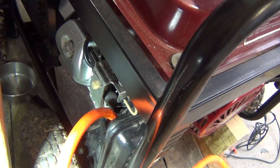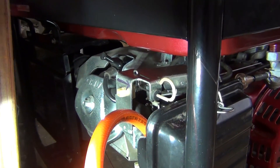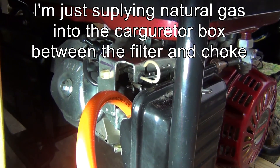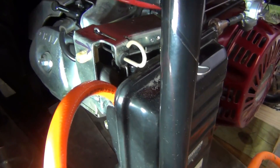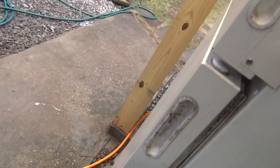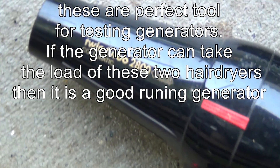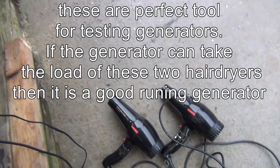What I came up with: there's a hole in the air filter box — I'm not sure what it's originally for, but it's pretty much for the return of unburned gas fumes to go back into the generator and burn again. That's where the hose goes in. I took it out and plugged in the hose from the natural gas line coming from my house around the corner.